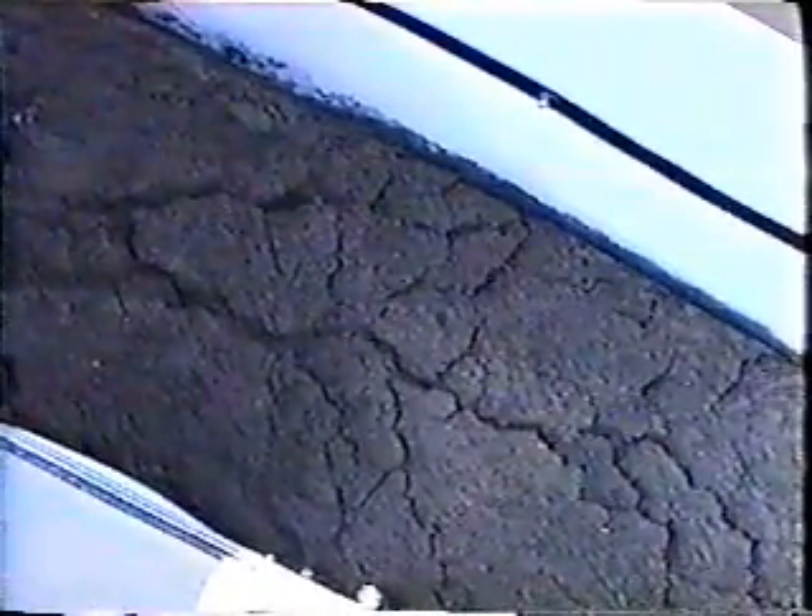We've got a little bit of residual water at the end because of the slope of the box, but we're getting a real good cake. This is after we've loaded the box, and every hour we've dropped it. It's a little deceiving on the height of the cake, but it's a slope — we did about a foot. You can see it's nice, cracked up, good water has gone through. Good cake. See the white? The white is that stone wash material. It's in there.